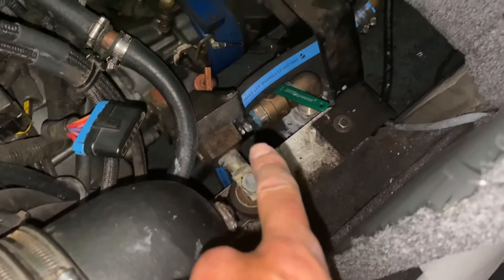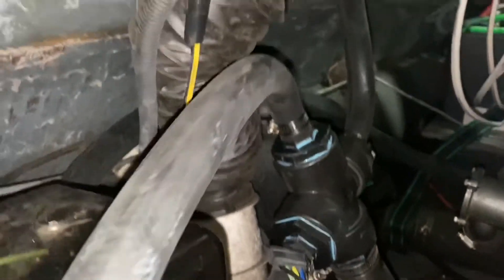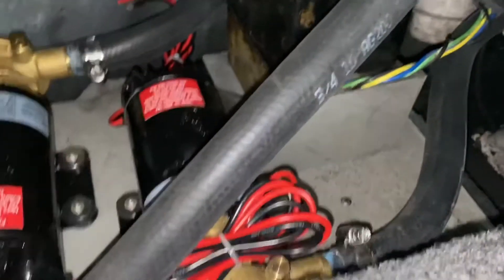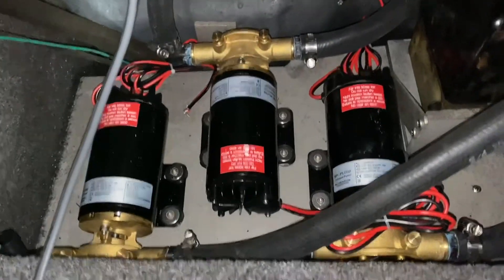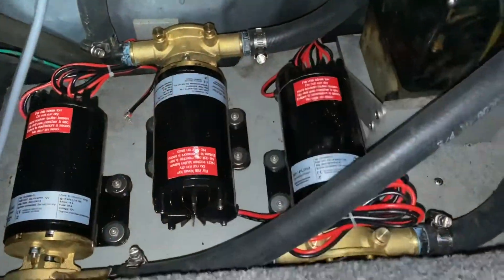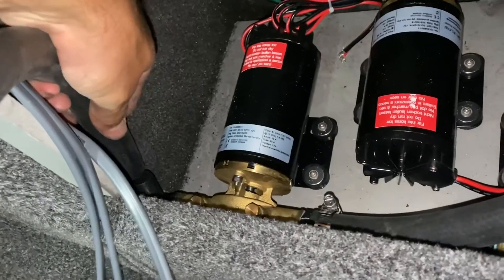I've got the main hose run here. The main inch and a half rubber hose is coming just off the valve and runs underneath the engine. What I did with this setup was come back here to a T — basically a cross — and then it comes out of that three ways with three-quarter inch rubber hose going to the three pumps, which I've got mounted right here. So we've got the inch and a half feeding three three-quarters, feeding the pumps. And then I just hooked up the first bag — the water's going to come in here, come out there, and go to the bag.